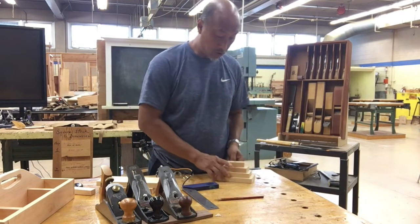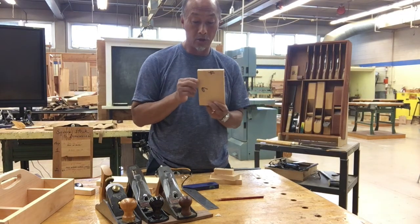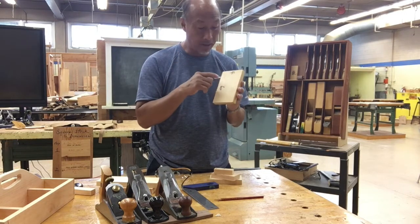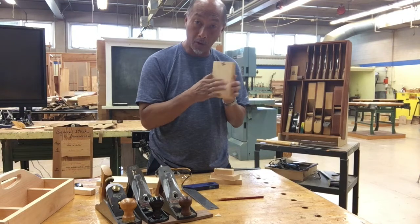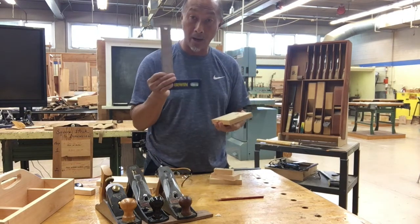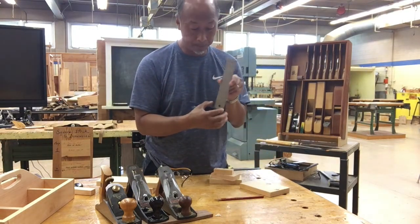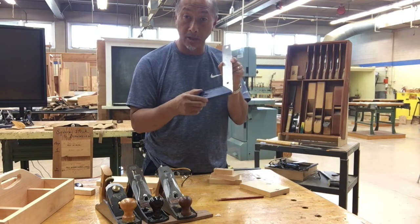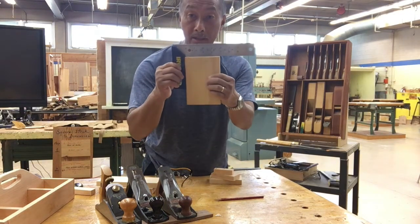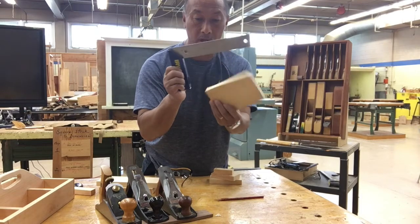You're going to make a piece of wood perfect — four inches by six. So you're going to cut and plane it down to a perfect dimension, not just a four by six, but it's got to be a perfect four inches wide, perfect six inches long. You need a square, which is a measuring device with a ruler that has a 90-degree angle. That 90-degree angle creates squareness on the side of a piece of wood, as you can see. So you're going to need this to check it for squareness.